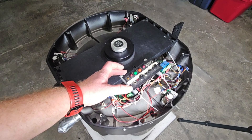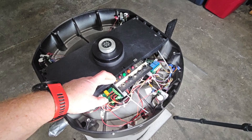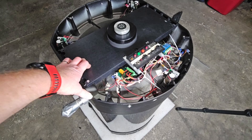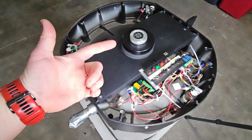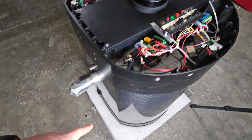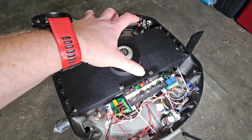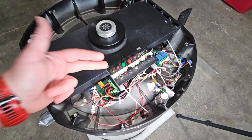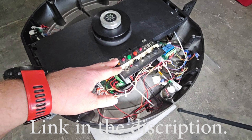This is what it looks like underneath with the rear plate removed. My scope has Charlie Trump's — not Donald Trump's — Charlie Trump's control board installed, because the RCX OTA uses three motors for focusing and collimation that are typically controlled via the Meade remote. Since I don't have the mount, I can't use that, so this board is one option for controlling those motors. The OTA also has a built-in dew heater in the front that this board can control as well. This was pre-installed when I bought the scope, but Mr. Trump does have YouTube videos on installation and these boards are still available to purchase.